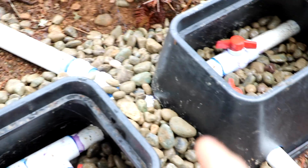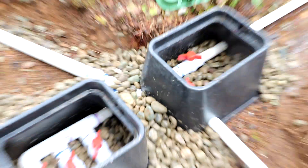They're controlled via this box in the ground. These two boxes have the valve manifolds in them. We built the valve manifold here — that one goes here, and the next valve is down and over. You can see how the valves are all adjusted slightly — not open all the way, but not closed all the way — and that makes it so the water coming out of the end is even, or as even as we're going to get it. We'll straighten up that last one. We put drainage rock in and under these things so when we backfill the dirt around here, they drain the water away.